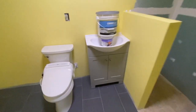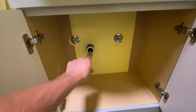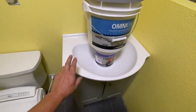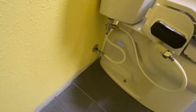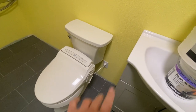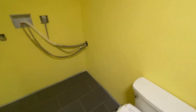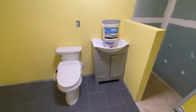Mission accomplished for today. We got valves in, trim rings, the drain for the sink — this guy's all screwed to the wall, this guy's glued down. Toilet valve is on, trim ring is on. We did not use wax; we used the new better-than-wax seal on the bottom, so we'll be watching that closely because it's the first time for us. Bidet is plugged in and ready to go. Next step is to finish painting and then assemble the sink when it's dry so we can put the faucet and drain in.